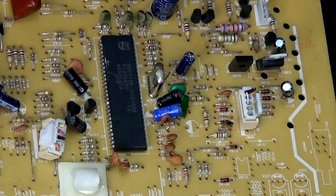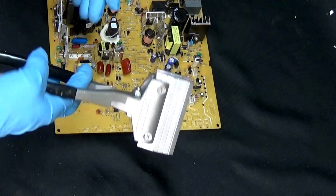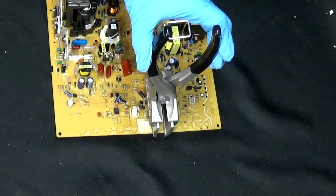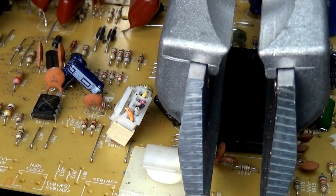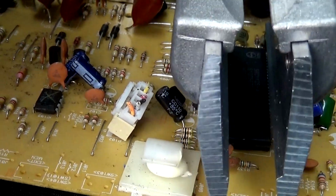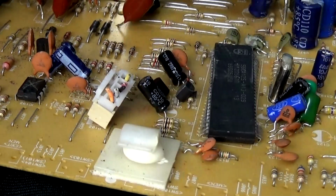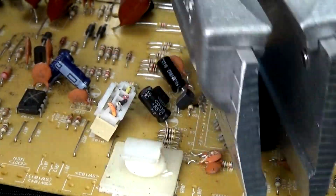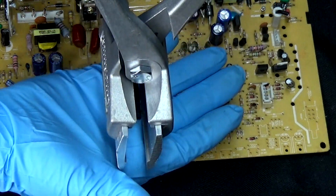Now this is a larger IC chip. With my pliers, this will definitely break in half. Use another tool called a metal bender. This tool will completely cover the IC chip, making it easier to remove. As you can see, it's taking the force for the entire IC chip and not just in the center that can make it snap in half. It does take a little getting used to.